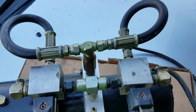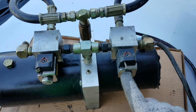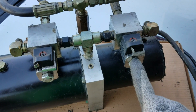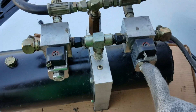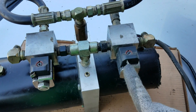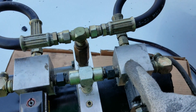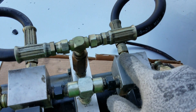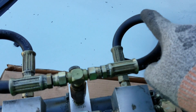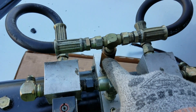When you hit the down switch — these dumps right here are self-grounding dumps, which are well known on these Reds pumps. Here would be your switch down wire. This opens up the valve here and closes and opens up this valve on the other side.